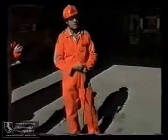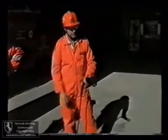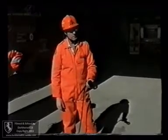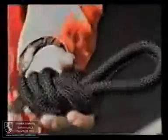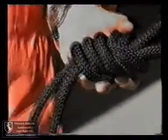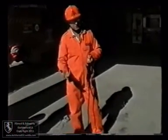It passes over the carabiner, so it's a wider thing. And where all the stress tests, it's a figure of 8 on the bite, tied in the bite, basically, yes. And most of the failure of these ropes occur here. So all we've done is we've opened up the surface area, so that's not biting against something small, because the whole trick with these things is they are at their strongest when they're at their straightest. So the more we can straighten them out, the stronger they are.